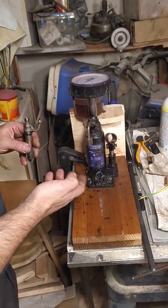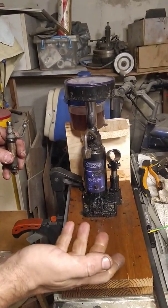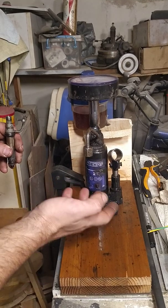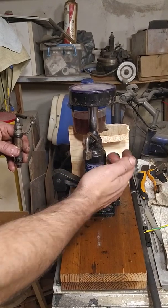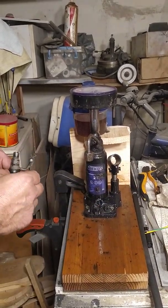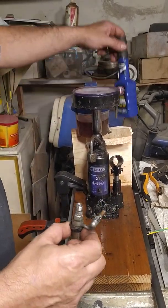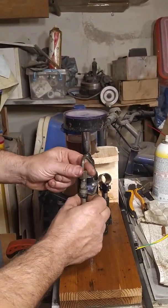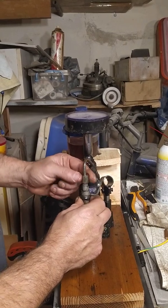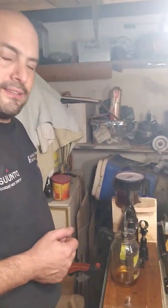This is a simple machine that you can find on YouTube, on other channels. It's a bottle jack modified to make a tester, hydraulic operated, but instead of hydraulic oil I used diesel, and obviously to clean the injectors I've added some diesel injector cleaner as well. So I'm going to attach it and start testing. Okay, the injector is in place